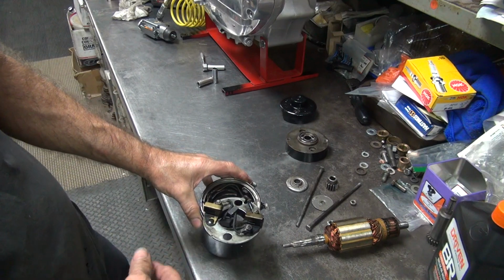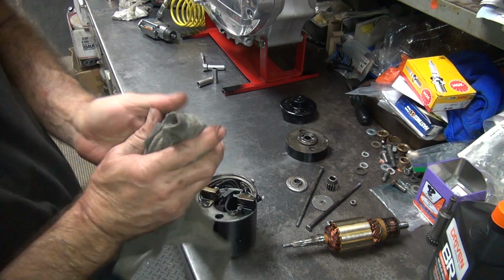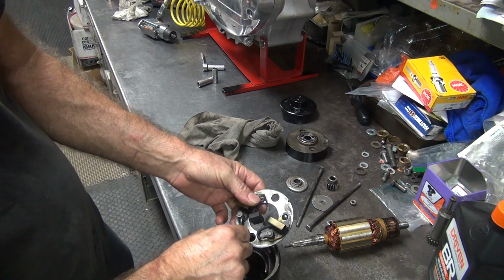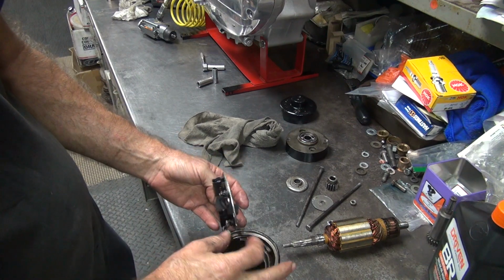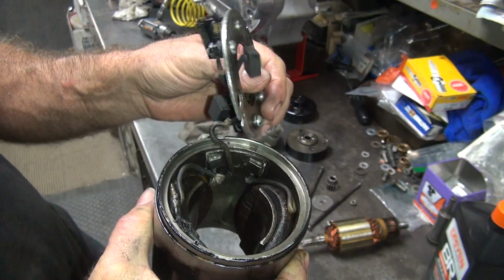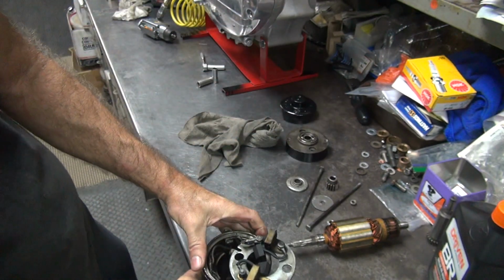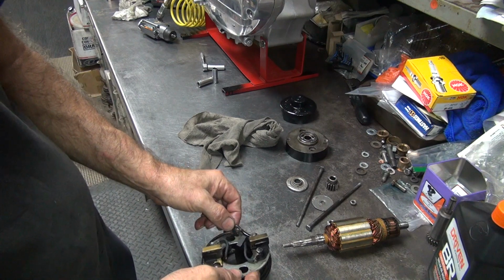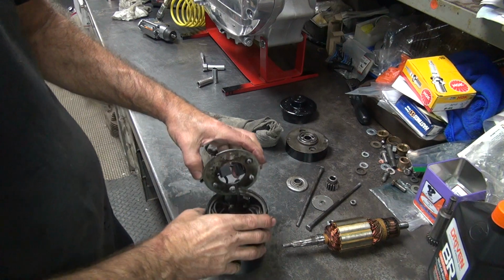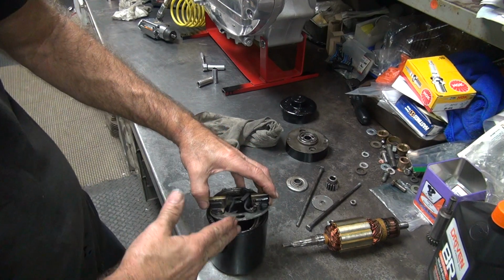You could probably put some electrical tape around them and put them back together. You know, probably will work. It'll tighten them up for a while, which is all you really want to do. You don't want to have them rattle around there. If they rattle around, they're just going to get loose and break. This wire here is pretty petrified. This is all original wire, so it probably wouldn't hurt to replace it. For now, it will work because it's not shorted against anything. So, considering the rusted condition of the generator, I'd say leave it alone. It's pretty much either got to replace a whole bunch of stuff in here or just leave it. And when it fails, it fails. More likely going to need field coils anyway.